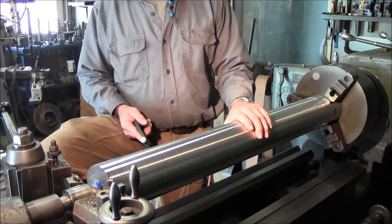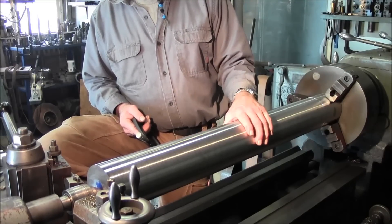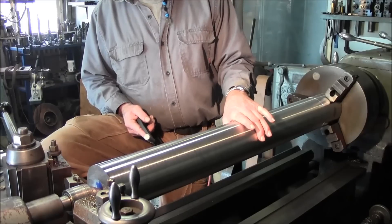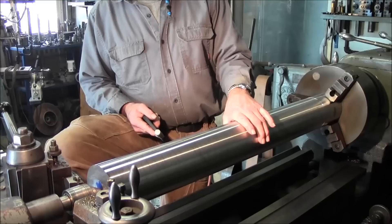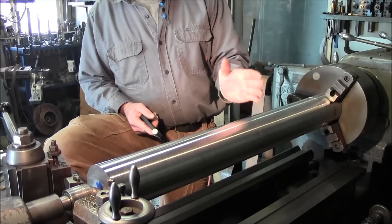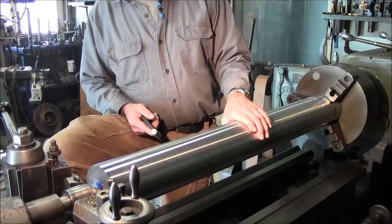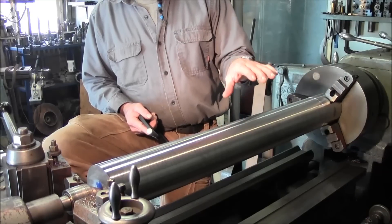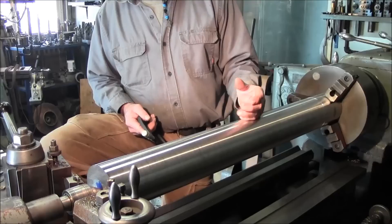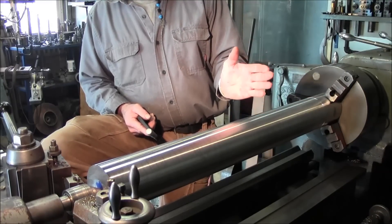This mean diameter in here - we still got to work on that flange and we want to leave plenty of meat here to play with so that we can open up that bore, make a nice true fit. We're going to make a press fit that flange to the shaft so that we can establish a true running flange with the shaft diameter. Because we want to minimize the amount of machining - we don't want to take anything on the register, but we can take a couple thousandths on the face if we have to.